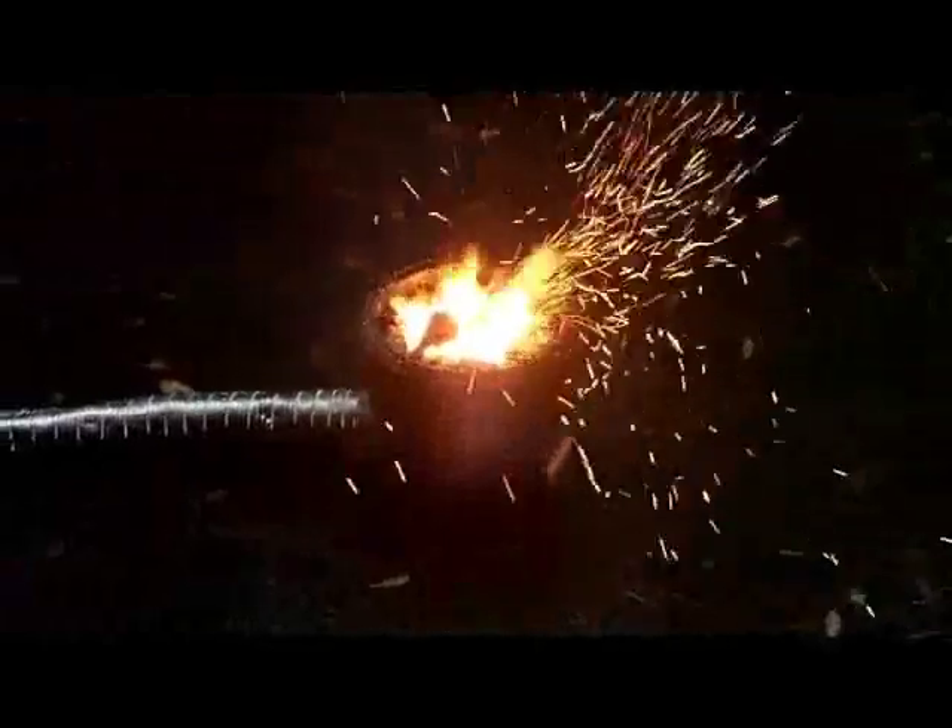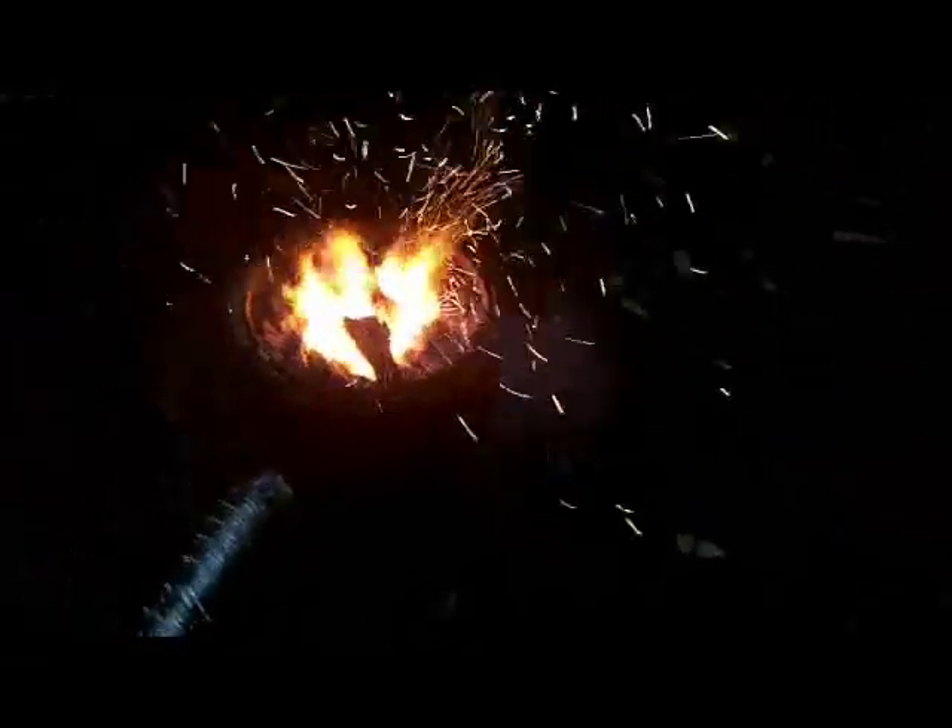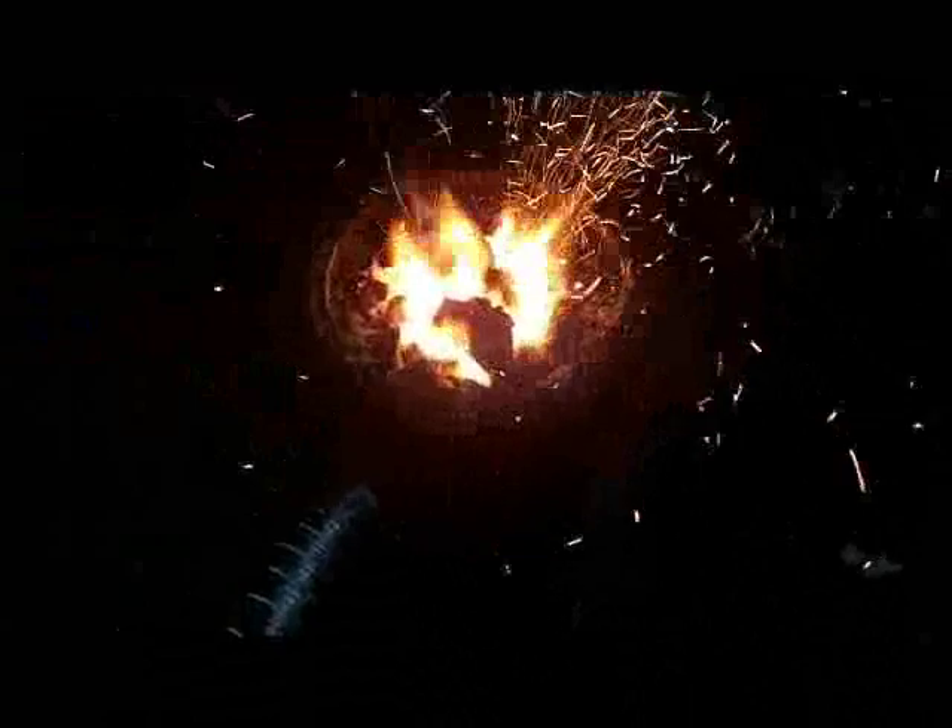I think there's a 'you know you're a redneck if' joke in here somewhere. That lump charcoal sparks a lot but it seems to be doing a better job than the briquettes did. It's a good day - we'll keep working. That is an awesome forge. I have to work quick because my anvil's wet, so I'm going to keep working on the taper of the knife right now.